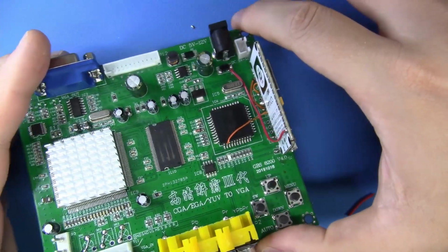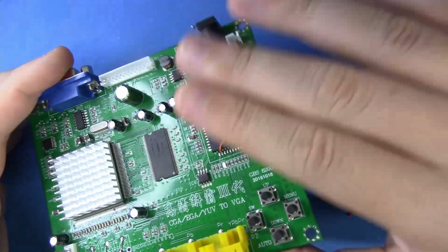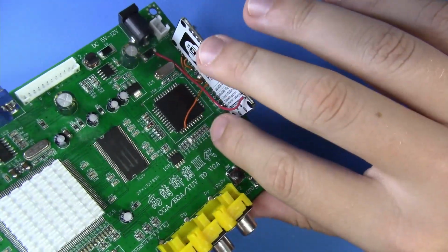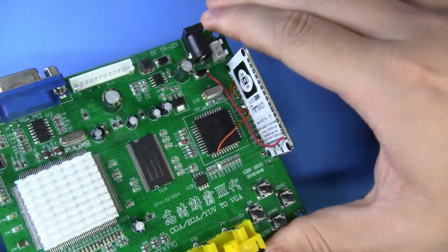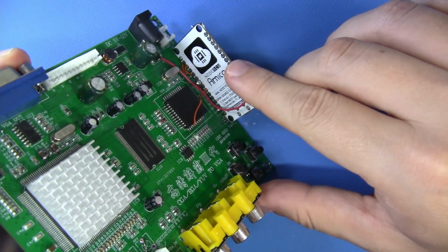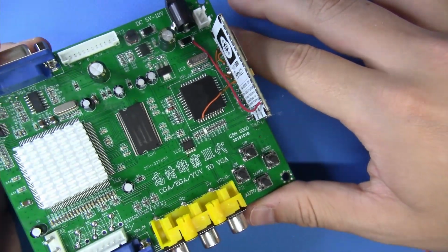Now guys, if you followed along this long, I am so proud of you. You've done a great job. This is the best way, in my opinion, to install this module. Now the way we did this has a few efficiency tricks. First of all, we directly interfaced our grounds from the main board to our grounds on our MCU, which means those are less wires that we have to physically wire in.